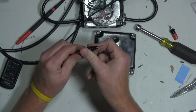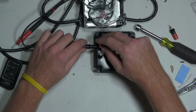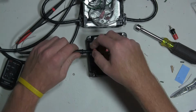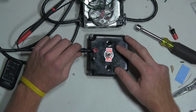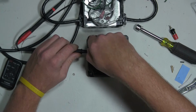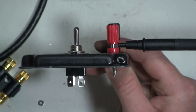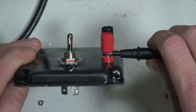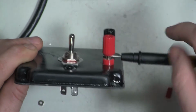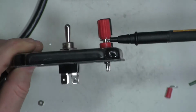With these particular probes, they wouldn't be all that unsafe because you can electrically insulate the conductive part of the probe, and you just don't stick it all the way through. You just stick it a little bit and then screw it down. So it looks something like that, and that would be pretty safe as opposed to having it stick out that much. All of that would be energized. So with these Fluke probes, I can insulate that. I think that would be safe to operate.